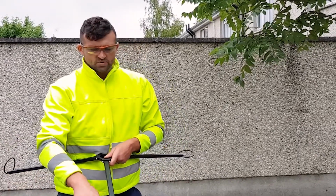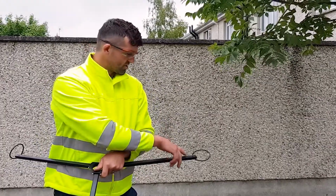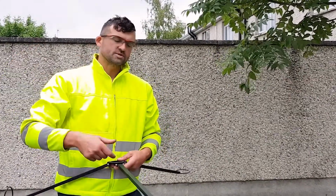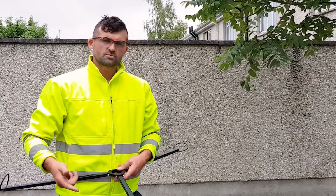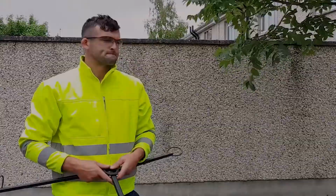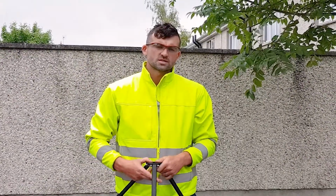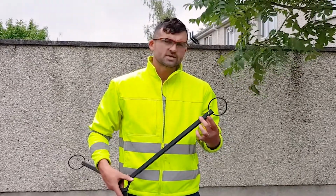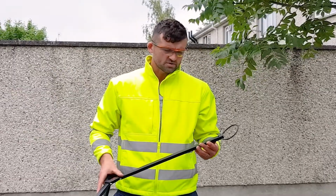So all we've done is we've added a drilled hole in each of the tripod star legs, and we fixed them down to the ground with concrete screws, pre-drilled first with a 6mm bit and a 6mm concrete screw as well. We're going to show you how to do this on site with a star. You can modify it yourself or get one from us, but it's basically putting an extra hole in so you can fix it to the ground, and it works.